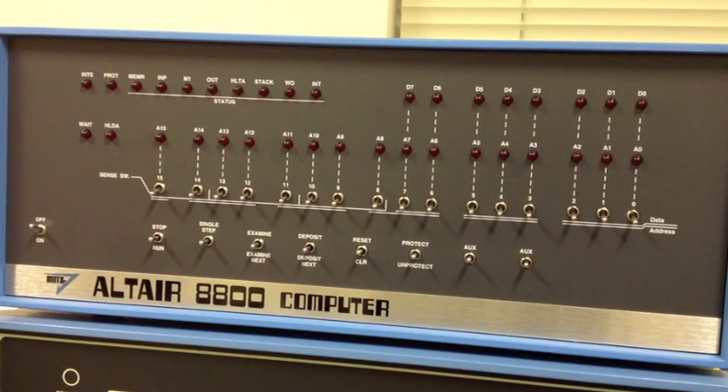Today we're going to load 8K BASIC, and it's actually going to load in about 20 seconds instead of 15 minutes as on a teletype. And on top of the read speed being fast, the punch is much faster as well — about 7 times faster. A lengthy program that took 5 minutes to punch on a teletype is going to punch in well under a minute on this device.